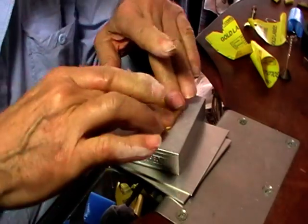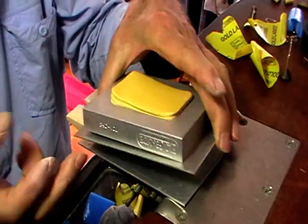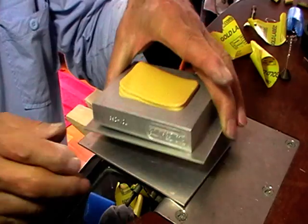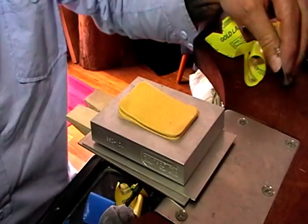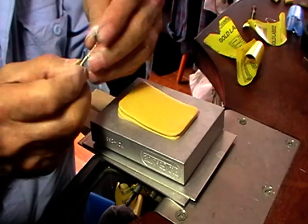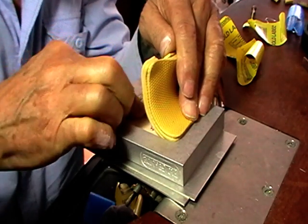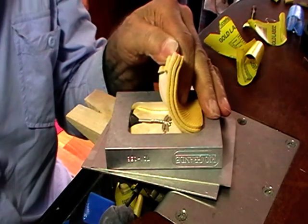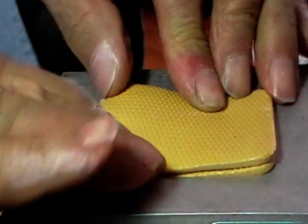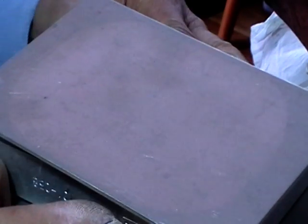Just make sure that it goes in all the way to the bottom. It's sitting on a protective plate, and this is just to keep the rubber from sticking to the platens — the platens on the vulcanizer are the things that get hot. So now we're taking our little dragonfly that I made, that I want to duplicate. Put it in the sprue former, position it inside your mold — just in the center. Push the rubber down, put the other protector on the top, and now we're going to put this in the vulcanizer.